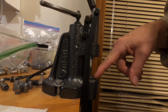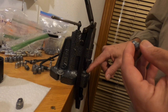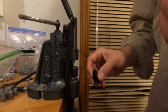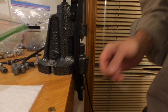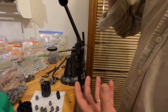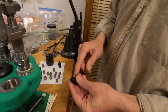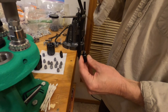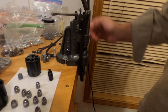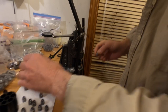But I've got a process which I call 'heeling the bullet,' and it's simple. I put an undersized die in here — this is a .439 diameter die, but we're not sizing the bullet to .439. All we're doing is using the tapered part at the top end of the die, and I'm going to use the gas check seating attachment, which just blocks the little center pin from going down more than a little ways. That's the standard gas check seating insert. If you need a longer heel or a smaller heel, you push the bullet in deeper — you can get any number of these. You can see where I've ground this one down so it'll allow the bullet to come farther into the die and give you a longer heel.